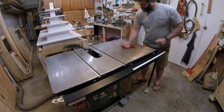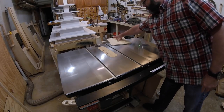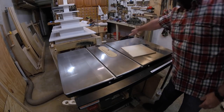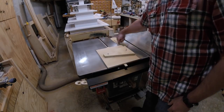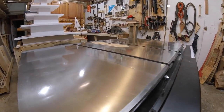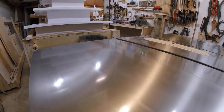I can tell right away that this is not as slick as the water-based poly — not that this isn't plenty slick. Wood and my jigs slide on the table with no problem, but it just doesn't seem as hard as the water-based poly. Maybe some additional cure time will take care of that. I'll be sure to keep an eye on it and let everyone know just how durable this will be. Worst case scenario, I'll sand it back down and do the water-based poly.